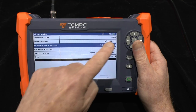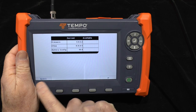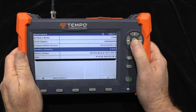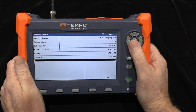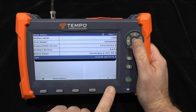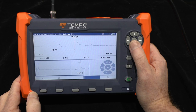Under 'About Device' we have the model type, the serial number, and the current firmware. Inside that menu pressing right gives you the option to update if you've placed files onto the SD card, information about the hardware version, and the current battery status. The time and date is best set at the beginning because it is tagged to all the files you're working with, making it easy to tie files on the unit with actual jobs done through the week when you come to do reports.